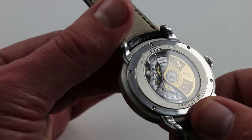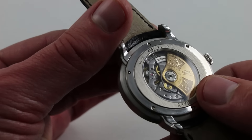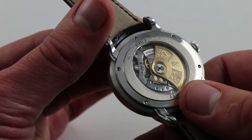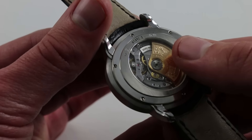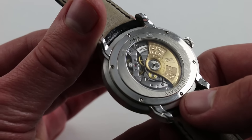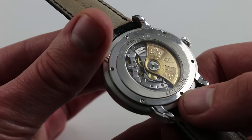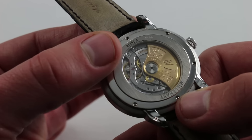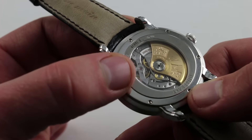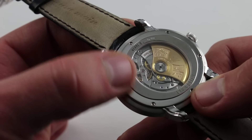Mechanically, you can see the full balance bridge with free-sprung balance assembly, the better to resist shock-induced timing variations. It has approximately a 55-hour power reserve via bi-directional automatic winding. Audemars Piguet chose bi-directional because it doesn't have the unloaded rotor wobble found on certain unidirectional winding calibers. To make up the loss in efficiency, Audemars Piguet uses unlubricated ceramic rotor bearings at center — sealed for life — ensuring long-wearing durability and increased winding efficiency. There's also an even and gloriously tight perlage pattern across the base plate, and a beautiful mirror anglage finish with polished screw heads and chamfered slots on the balance bridge.